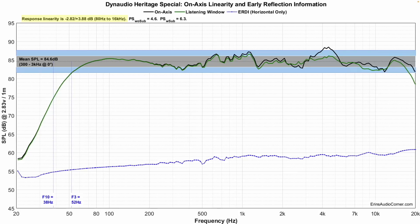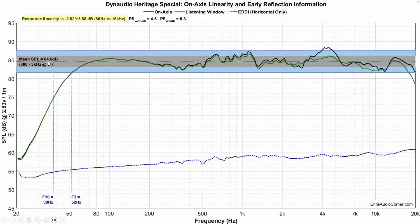This is the on-axis frequency response in ported mode. You can see it's mostly within plus or minus 3 dB, except for a strong peak at 4 to 4.5 kilohertz — and that's a very strong peak. I believe that's the issue I was having in my listening sessions. There's also a dip around 1.2 to 1.5 kilohertz. If you watch my Special 40 review, I identified this as a compliance issue between the surround and the cone edge — I think that's the same thing here. The overall sensitivity trend line is about 84.6 to 85 dB at 2.83V/1m.